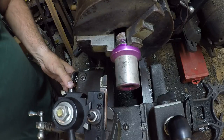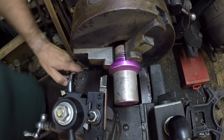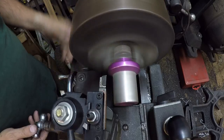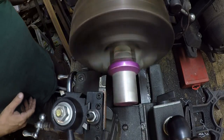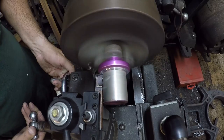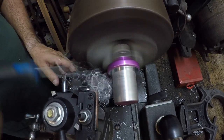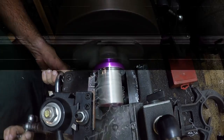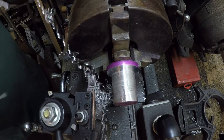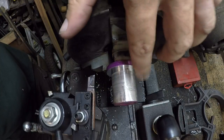I've got a left-hand carbide cutter in here — it's just what happened to be in this block. I could have set up a new piece, but whatever, this is good enough. Let's start making some chips. Let's disengage the gears over here first — those things are noisy. Those are some pretty wicked chips there. That looks like it worked pretty good.